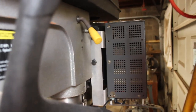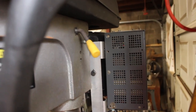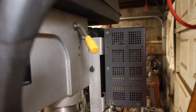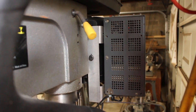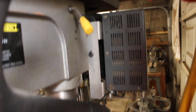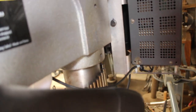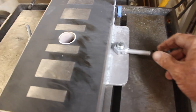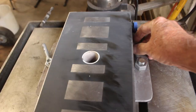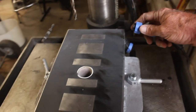The other power supply was 12 volts at 6 amps; this one is 5 volts at 25 amps — this one works a lot better, so I decided to go with it. It's mounted on the side of the motor mount; the power wire goes up and plugs into the side of the light bulb adapter — when you turn on the light, it powers up the power supply. A quarter turn on these locking nuts loosens them enough that you can move the whole unit. Now let's hook it up and see what happens.